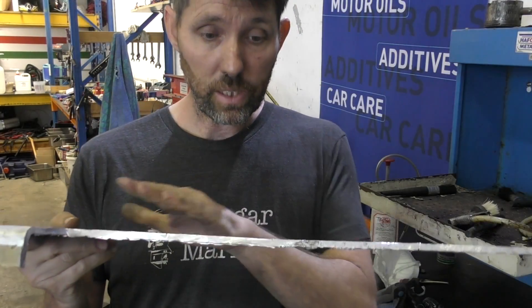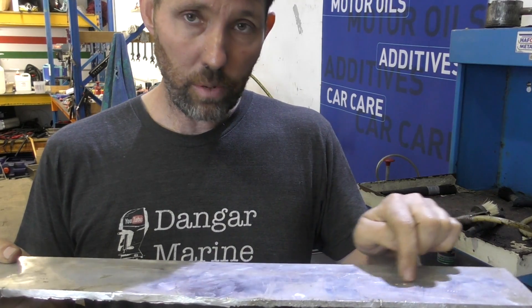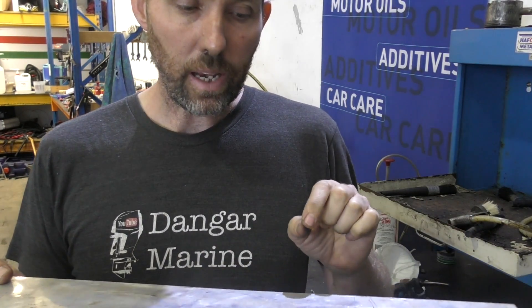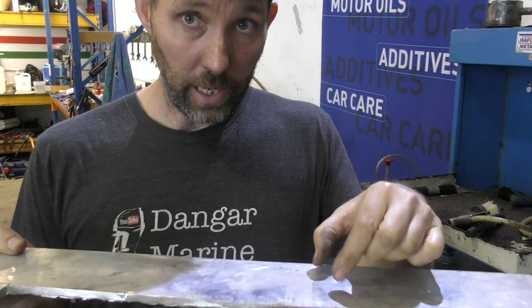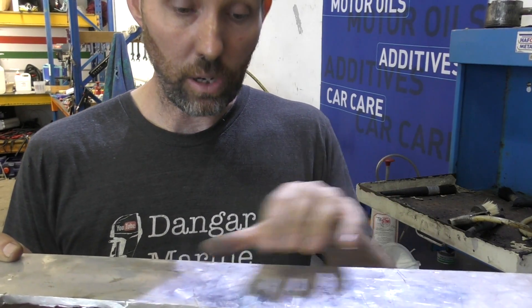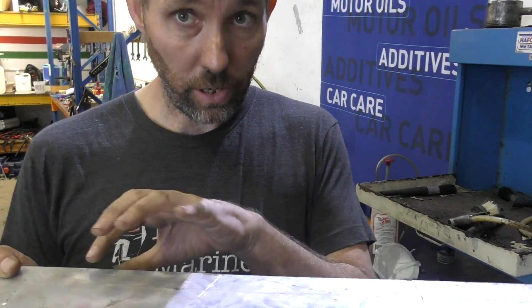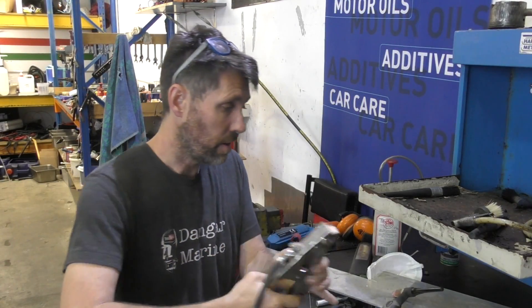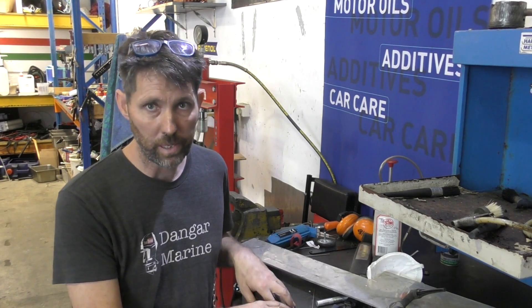What I'm going to do now is take a relatively unprepared piece of aluminium and without any filler rod, just run the tungsten along it. I'll show you that section — you'll see a width of metal where that cleaning action has started to clear the oxide layer. I'm going to clamp the ground straight to the aluminium itself, but you can clamp it to the bench and have the aluminium on a metal bench.